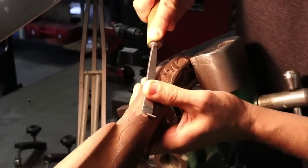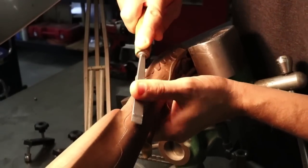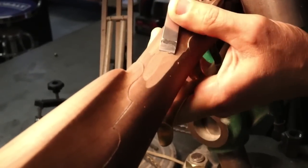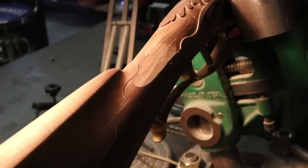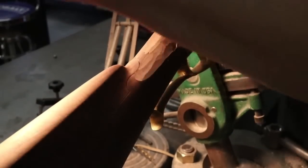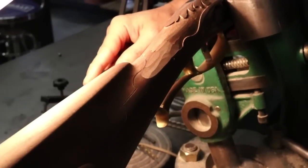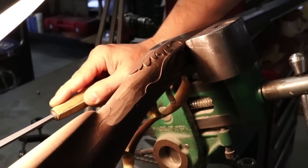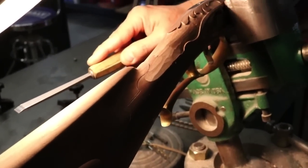One thing that's really important with carving is to watch the grain direction. It's hard to describe if you're not familiar with it, but there's generally going to be one direction where the wood will cut well relative to the grain direction. If you try to cut it in another direction, it'll tear and pull out, so you have to be very mindful of that — it's a constant battle. This walnut has been carving pretty well in a lot of areas, although some areas it's been very unforgiving of cutting against the grain. Sometimes you're occasionally forced to cut against the grain based on the carving design, and if you have to, you use a very, very sharp tool.